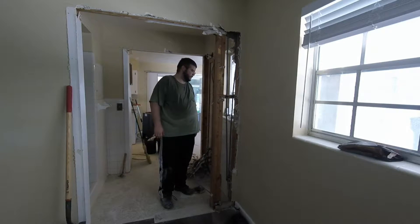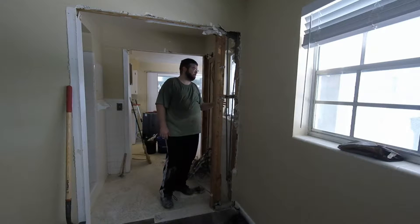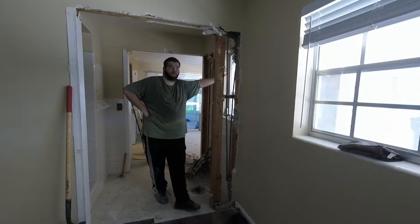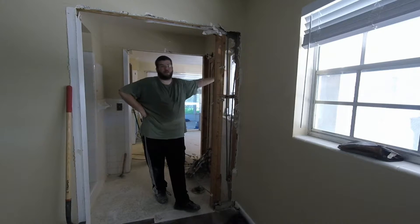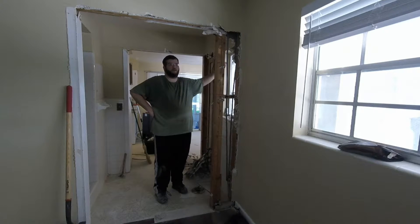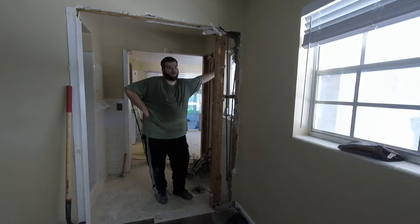The inside of the window — there's a good chance the window's going away. We'll eventually enclose the garage, and since I'm tearing out all this drywall and plaster already, it's only going to be a couple extra dollars — maybe another 50 bucks or so — to enclose this window. It's about $1.15 per block. Then we're looking at a bag of Portland cement, and I'll rough up the opening, put in some rebar across it, and stack some rebar to reinforce the block going in there — just for peace of mind.